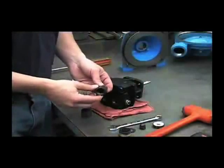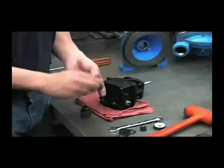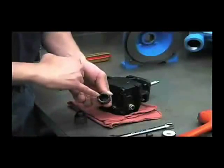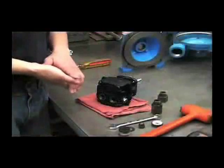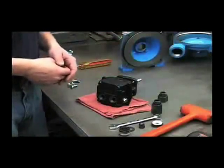There's a check valve inside of the tank adapter — you should be able to hear it rattle. If you don't hear a rattle, you can take it apart by removing a snap ring inside and cleaning any contamination. If the hydraulic lines are hooked up backwards, it may cause damage to the hydraulic motor seal. Let's take a look inside.